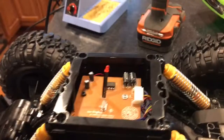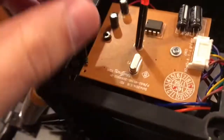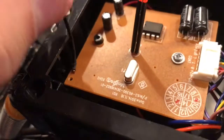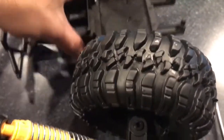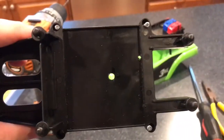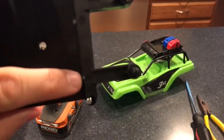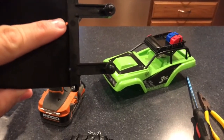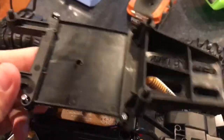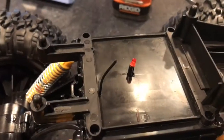One other note on the antenna: the circuit board antenna was soldered on the bottom and originally looped through a hole next to it, running it pointing up. I just pulled it back out of the hole so it's still pointing up. I also had to drill another small hole because the original hole was on the other side — since we flipped the circuit board, it's now on the opposite side. So when I put this back together, the antenna feeds through that new hole.